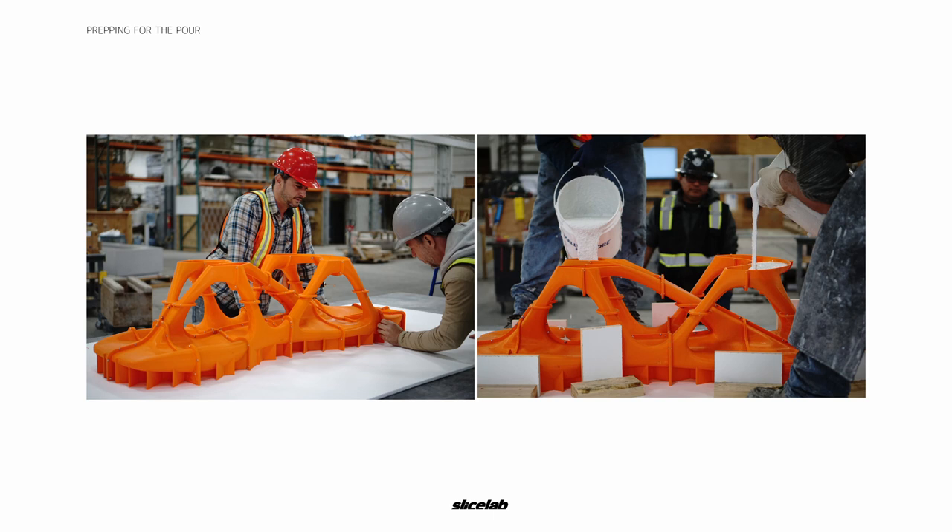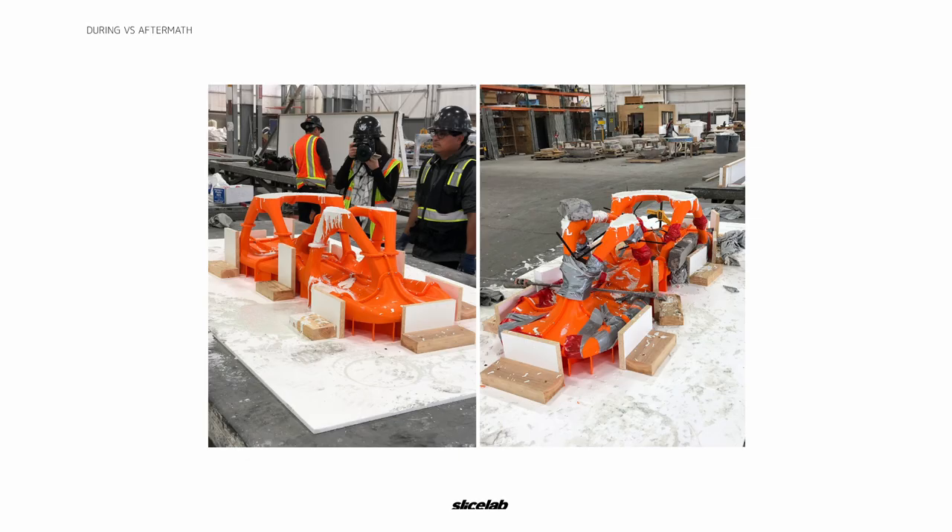The main cavity filled up very smoothly and quickly because of the vibration table we put it on. We set up the table over a piece of foam for the vibration table, and set up wooden jigs around the outside to contain the mold and prevent it from moving around. Right after we finished pouring the concrete, we were pretty happy with the result — we thought it was looking good, but we did have our suspicions. This was not at all what we expected. We started realizing there were hot pressure points and bubbles forming, and two minutes later this thing started rupturing everywhere. We had to run around and drill as much as possible in the areas we could feel. In the end, we salvaged the piece, but had to do a lot of different things to fix it.